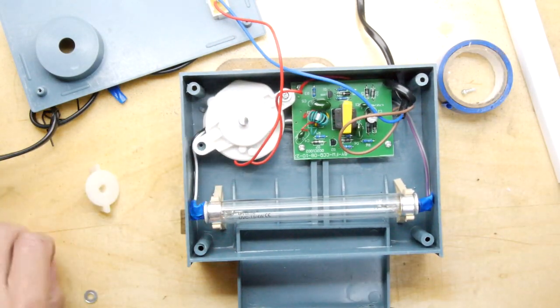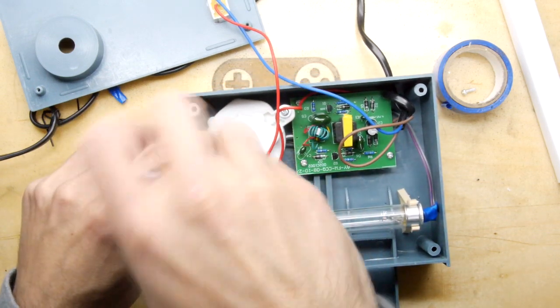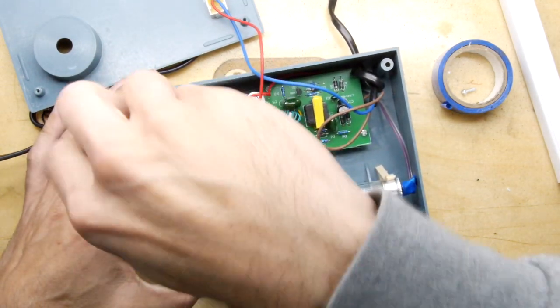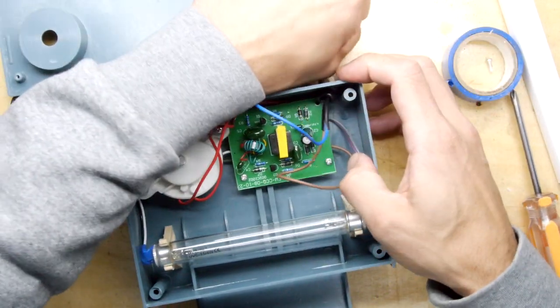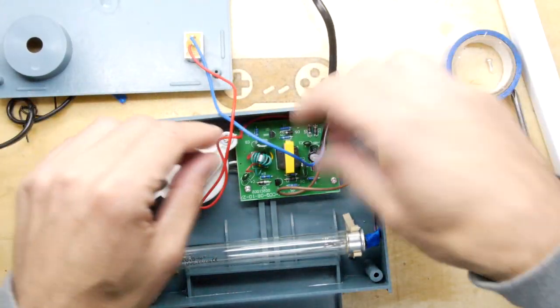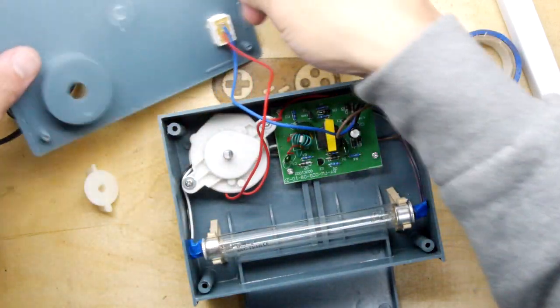Let's get that in like that - it's very dainty, isn't it? Looking at it, we have a lot of other random wires that are just all over the place. The mains cable actually has a knot in it as strain relief, so do be careful. We'll check that out momentarily. I'm going to put a UK plug on this - but let's just check that out. It's kind of got a strain relief grommet anyway, but then they've put a knot in for belt and braces. Probably what I would advise is test that - so you get the knot a little bit tighter, so that's not going anywhere now.